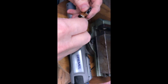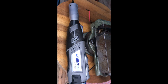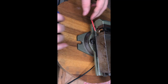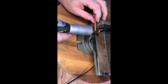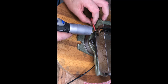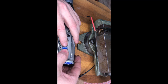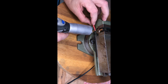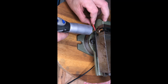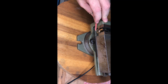The DREMPIC lock-picking tool combined with the Dremel 8220 gives you more power than other electric pick guns. It uses two roller bearings to provide smooth operation and a heat-resistant material to house the main lock-picking movement. The operation of picking locks at higher RPM is quite violent, and the choice of materials and mechanics of the DREMPIC have been tested by our locksmiths over a long period. The cam that attaches to the collet of the rotary tool and the cartridge assembly should be replaced if damaged — the lifetime warranty of the tool does not apply to these consumable components.